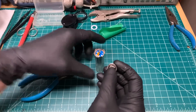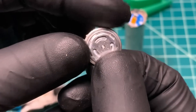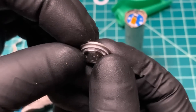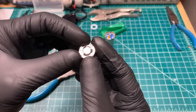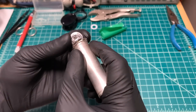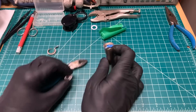What we have up on top is the top contact, but then underneath that, accessible through these slots, is what's called the CID, or the Current Interrupt Device. That is sort of a circuit breaker that trips if too much internal pressure is generated inside the device. The battery itself functions by this metal tab here, which gets spot welded up to the bottom of this top contact structure.